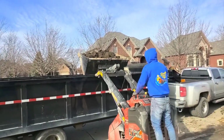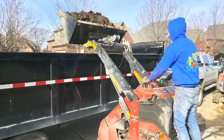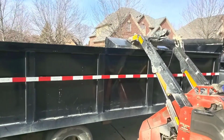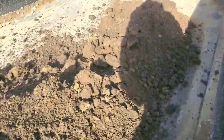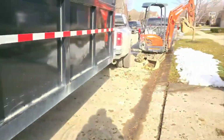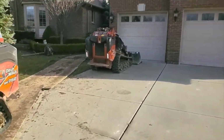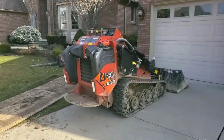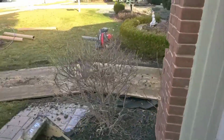The reason why that looks like topsoil, it's because it is. When they tried to raise the backyard, they hauled in 30 yards of topsoil. It didn't dry up the yard. And it usually don't. You have to pipe it out. That's the only way. If you have water, if you have a low spot, if you have a collection area, run a French drain.